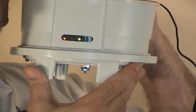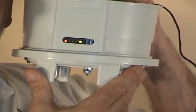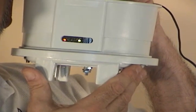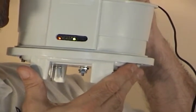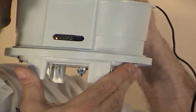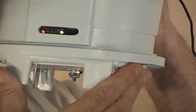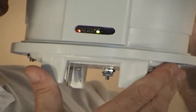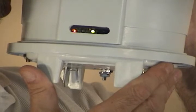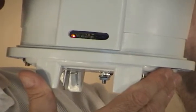There is a certain condition of blinking that will let you know that you are at the 125 volt level or higher — between 125 and 126, which is the high-end last volt before you get out of spec on that 5% range we talked about. Also the LED will flash to let you know if you're down between 115 and 114 volts, the last volt before you get to an out-of-spec condition. So as soon as you plug the unit in you'll be able to tell if you're between 125 to 115, or if you're actually approaching 126 or 114. That's all illustrated in color in the manual.